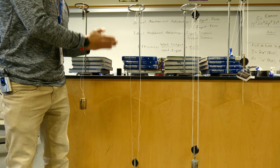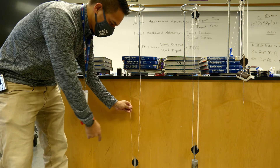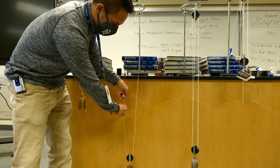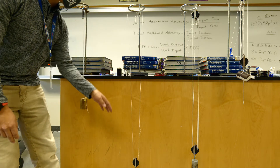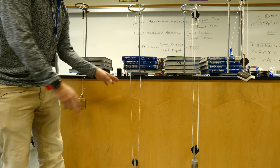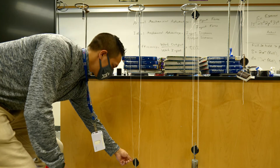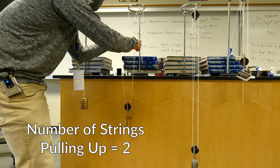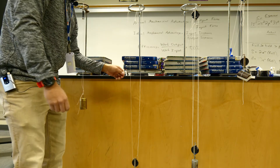So this is now going to be our second pulley. In this system we now have a movable pulley. The difference between this one and the first one is that this pulley now can move with the weight — as we pull the string, the pulley actually rises with the weight. We still have a one kilogram mass on here. We need to count how many strings are pulling up on this weight: we have a first string pulling up and a second string on the other side, so there are two strings pulling up. Record that on your data table.